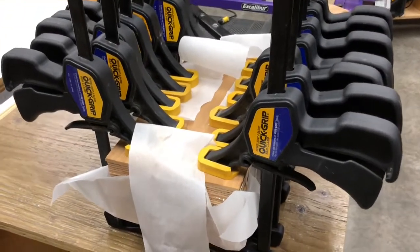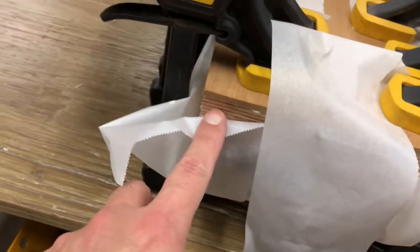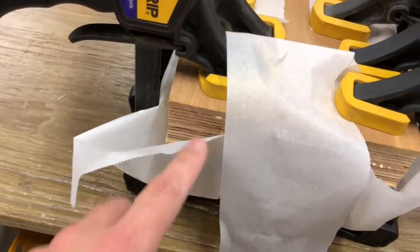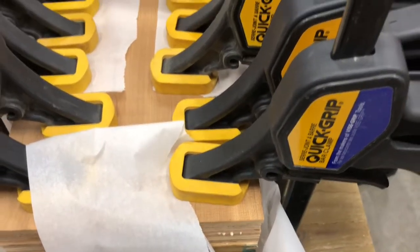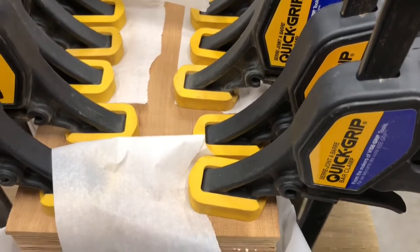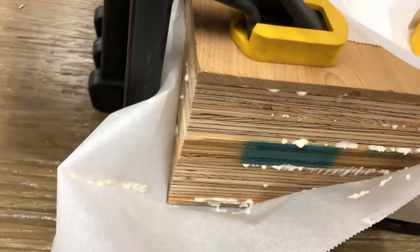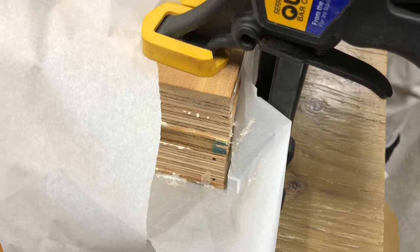That's a little bit better. Now that I got it smoothly straightened out, nothing that a couple seconds on the chop saw or belt sander won't fix. I have all these quick grip clamps — if you look at one of my earlier videos, I looked at all the different clamping forces. Not the greatest in the world, but with this many clamps I got some glue squeezed out. I don't do crazy on the glue. I don't believe that you need enough squeezing out that you could kill a small herd of animals. Never had a glue joint come apart.